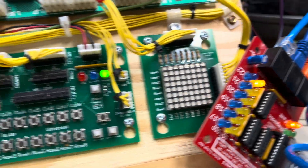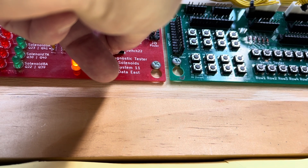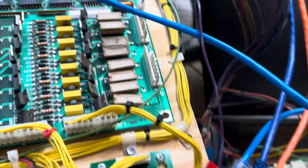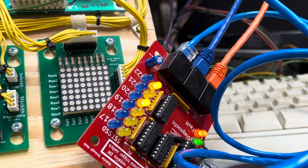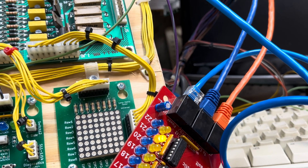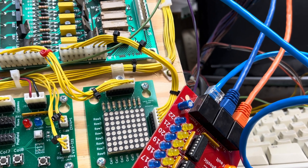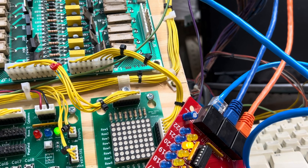Let me get into test again. I'm still holding that button down, and you can see that I'm pressing other special solenoid inputs, but it is not letting any special solenoid outputs go out. Now if the fault clears — like I just let my finger off that button — you've still got an annunciation of a fault. Nothing is going out to the solenoids. I'm pressing these buttons and nothing is going out. What was happening earlier was I was in coil test and it was trying to fire some.